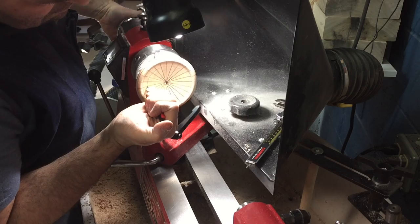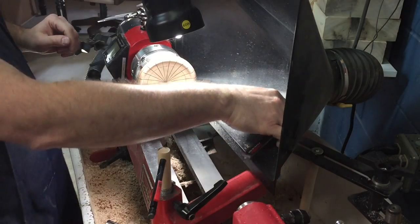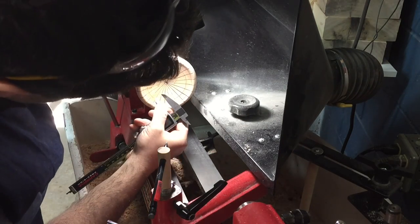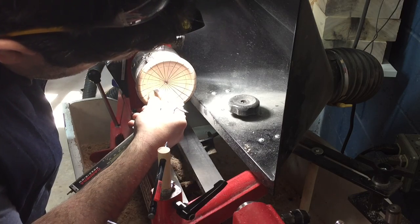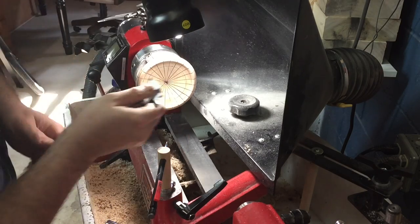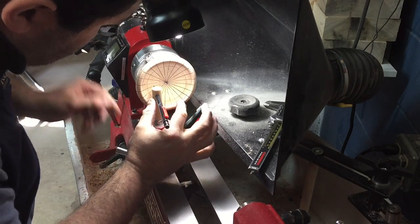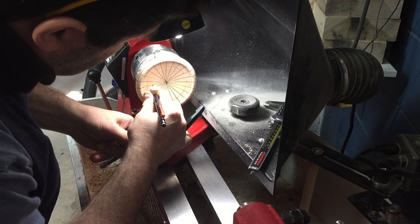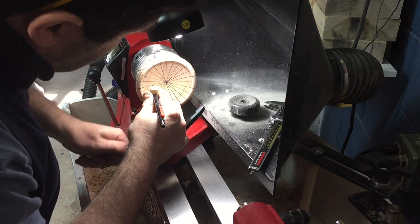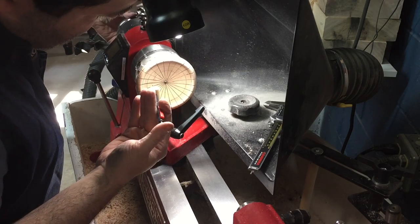Here's an indexing tip: I'm pressing in the end of the mechanical pencil to push out the lead to actually draw the radial lines. I didn't have to do this with the horizontal lines, but I do have to do it with the radial lines. I do this because it's much easier to press in the pencil lead than it is to press in the entire banjo and jig.